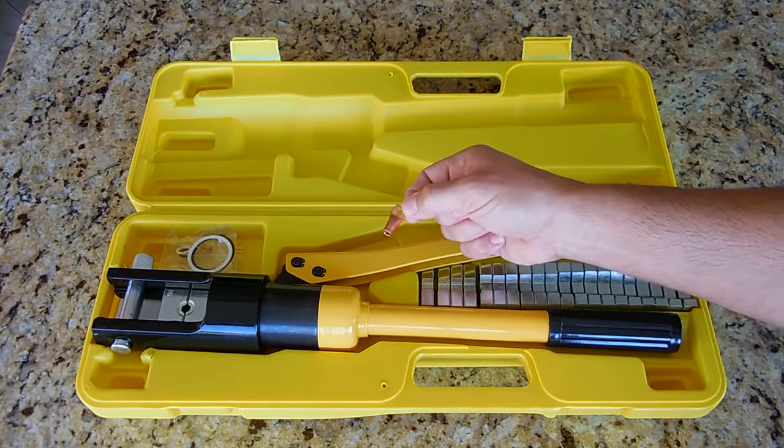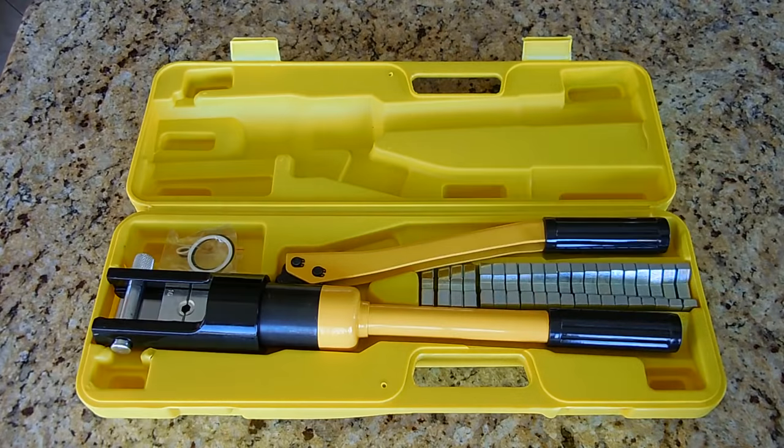So what I ended up doing was soldering the connector directly onto the copper wire, and it worked extremely well. Some people questioned, saying it's going to be a higher resistance connection. And I never experienced any problems with any cables that I made, all the way up to 1-aught or 2-aught wire. Everything worked just fine.